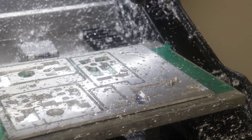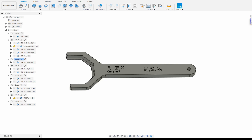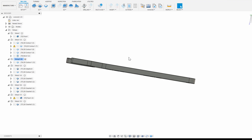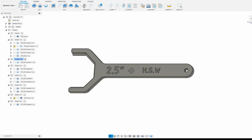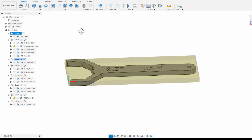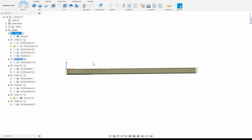So I told him a simple flat steel wrench is actually a great job for the DMC-2, so I'll make you a pair. After some back and forth, here's a simple design I came up with. This wrench is made out of a 3/8 inch thick flat bar of 4140 alloy steel and it has a 2.5 inch flat-to-flat octagon end for the nut. The whole thing is about 9 inches long, and just for fun I added the 2.5 inch label and his initials to make it a little more unique.